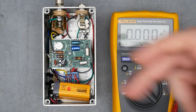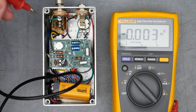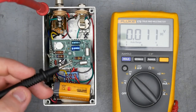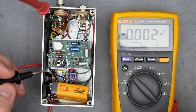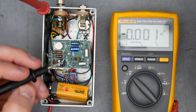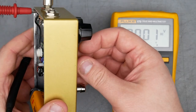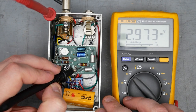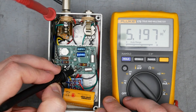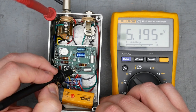Let's test for some voltages. We have PNP transistors and no voltage regulator or voltage inverter on our PCB, which means we are running positive ground for this fuzz face. That means we connect the positive lead of a multimeter to ground and probe with the negative lead, so our multimeter shows positive voltages on screen. The most important voltage for a fuzz face is the collector voltage of Q2 — that's what the sundial controls. We're reading 5.28 volts, sundial right at that center detent. Analog Man targets about 5 volts at the collector, and we're reading about 5.2 volts — totally normal, battery might be a little higher than 9 volts, which could explain the slight discrepancy.